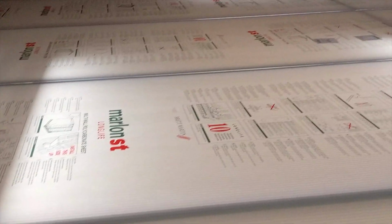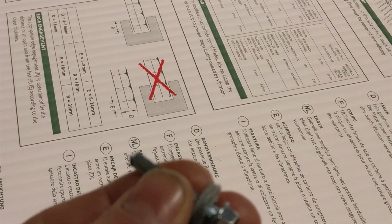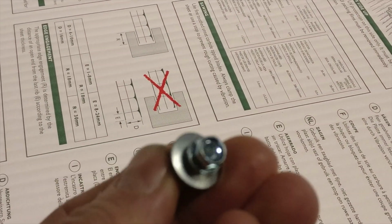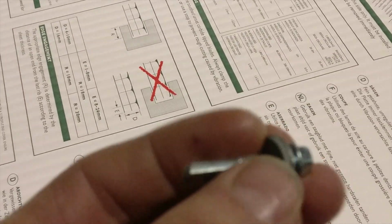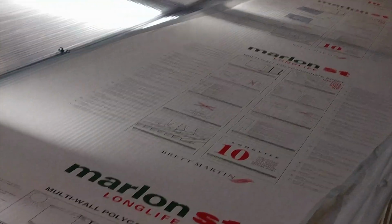the roof down. So it's, I guess, 4 meters in that direction. So I think I'll put a fastener every 1 meter. And then you can kind of see the spars going across. I think that'll do the job. These are the fasteners I've got. So self-drilling, self-tapping. Hopefully be better than the eBay ones for the sides I bought. But they've got these little rubber backed washers. I had to do at least one video of some of this coming off. Yay! I think it's going to come off there for a second.